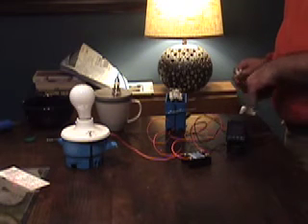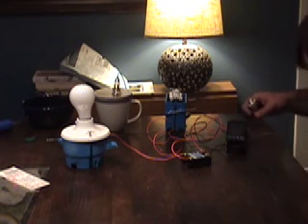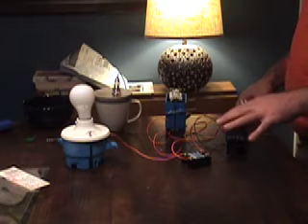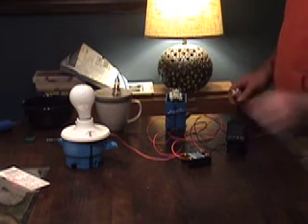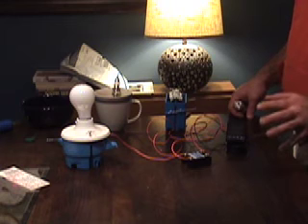Off of here I have this wired into my solid state relay — it's a 40 amp relay. This, by the way, is a SYL-2352 with a solid state relay, so everything's wired here correctly. I have an RTD sensor wired in here that's sitting in a cup of water right now — that's hot water. Basically I just want to give an easy demonstration of how this is set up.